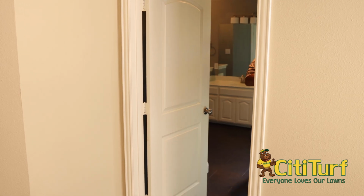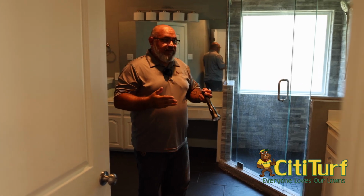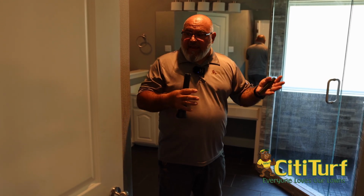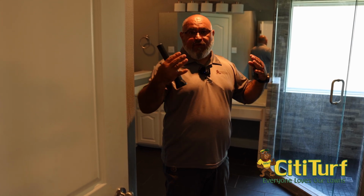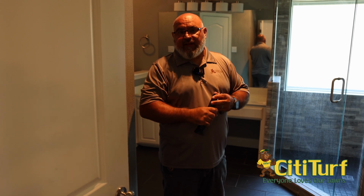So now when you're checking master bathrooms or any bathroom, you think it's a heavy water source. So you're going to have heavy water activity, moisture, stuff like that. So you really want to look specifically around your bathtubs, your showers, your toilets, because those are going to be areas of prime moisture. Because one, you're taking showers, doors are closed, moisture's kind of flowing around. And we'll notice with this master bathroom, you'll see a lot of staining on the paint where the moisture has really kind of just flowed down and created water stains on the paint.